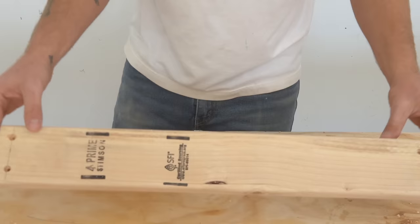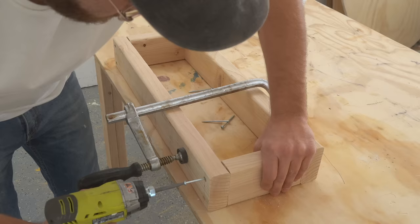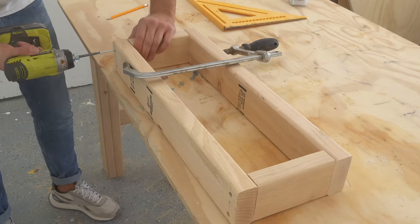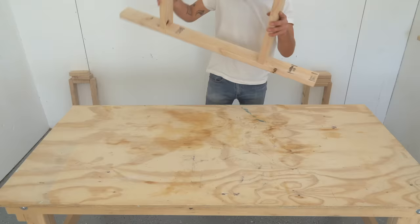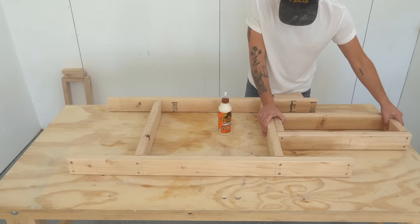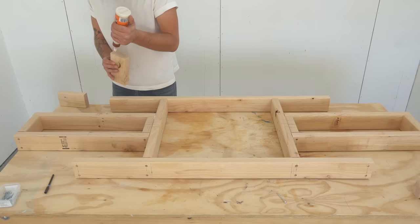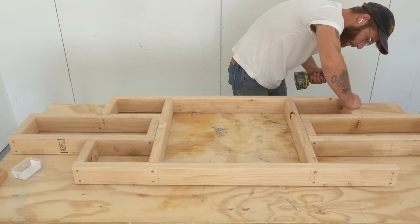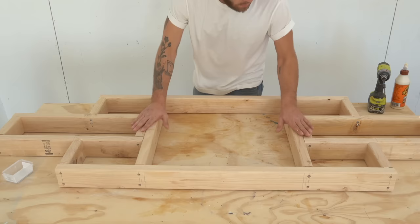These 24-inch long, 9 and a half inch wide extensions or arms are going to go on either side of the box for the turntable. I couldn't put a center spine through this entire build-out because the middle has to have that turntable opening, but I think we're going to make a really strong assembly. Everywhere I had a connection on this frame, I used glue and screws — I wanted this thing to be super sturdy. The 24-inch extensions get screwed into the center on either side of that turntable opening, then I added 6 and a half inch support blocks to make sure everything was straight. I probably could have built this out of 2x3s, but they were all really wonky at Home Depot, so I went with 2x4s.